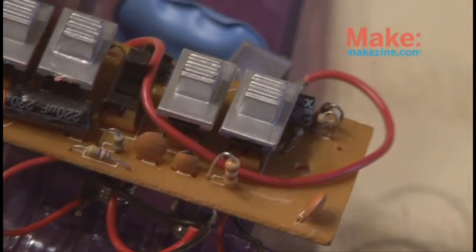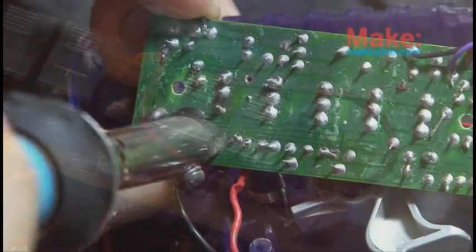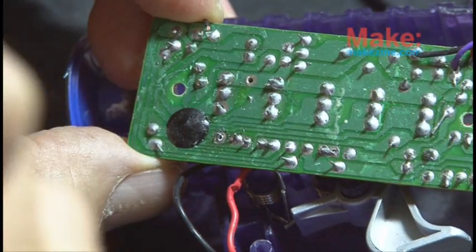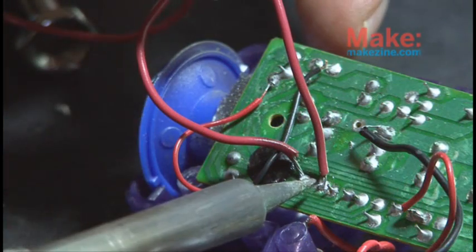To make sure you have the right resistor, you can touch the leads while the megaphone is on, and the pitch should go up and down. Now using our desoldering tool, we're going to remove that resistor, because we need to add 2 wires to the contacts where the resistor was.